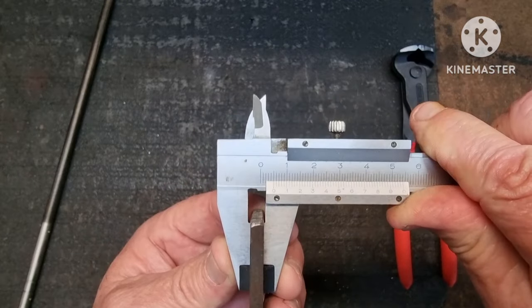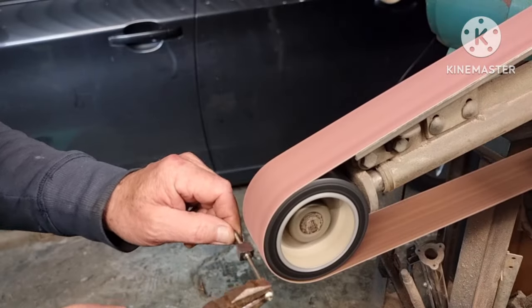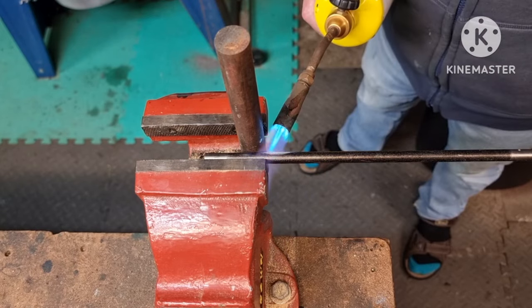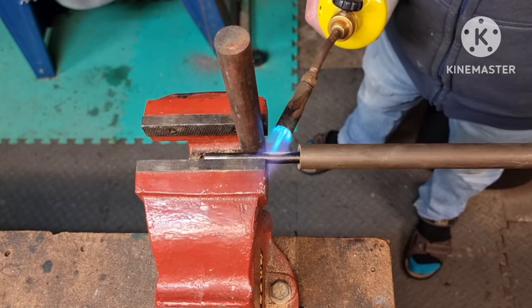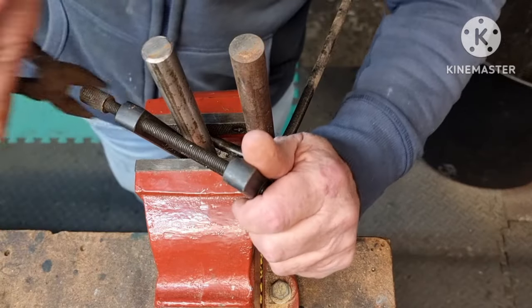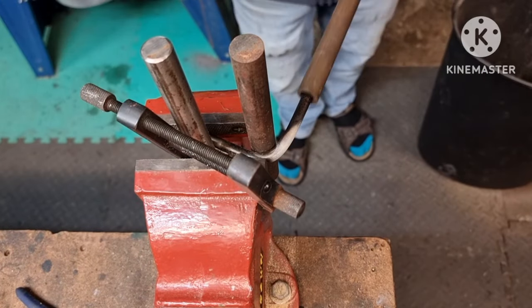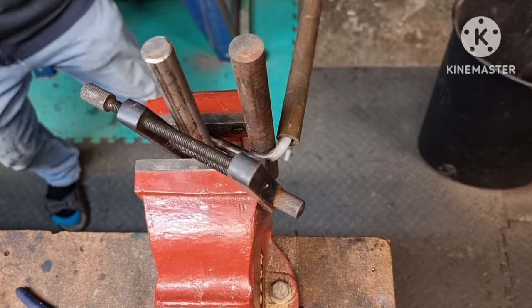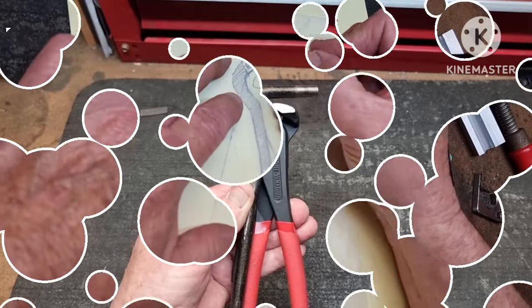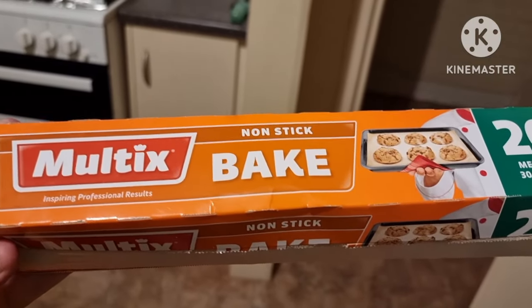After I modified it, getting started on the tabs. Before welding the tabs I figured it was a good idea to shape the handle, so I started heating up a 9mm printer rod to bend it to shape. I could have made this work but I think I've got a better idea — I'm going to cut it from a piece of 6mm plate. I couldn't find any tracing paper but baked paper does just as well.